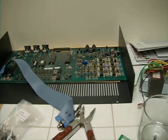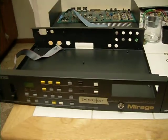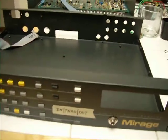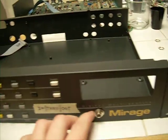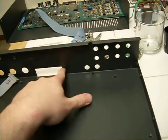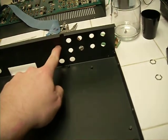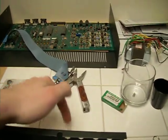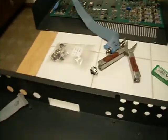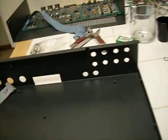Another mod I'm performing — which isn't quite as cool but will definitely be handy — is, because this is a rack Mirage, the audio input is in the back of the machine. When you're sampling and you've got this in a rack, you'd have to run a line behind it to get your audio in, which is a little inconvenient. So I'm just adding another little mono input in the front of it, mounted right underneath where the floppy drive would sit — there's plenty of room down there and nothing underneath. That's going to be run out through the expansion port slot or through another hole I'll drill, and it'll terminate in a quarter-inch jack that can plug into the audio input on the back or into an input sampling filter card, which I have but can be finicky at times. It's just a little jump from the back to the front to make things easier when it's set up in a rack.